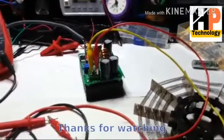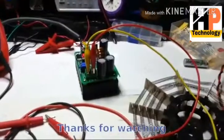Right, I need to have another little rethink about how I'm going to try and pull more power through that coil using this setup, because it can obviously do it, and the boost converter is alright at 12 volts. Maybe I should try the other power supply on this and see if the other power supply is giving out enough power. Yeah, that's going to be the next lot. I'm not going to do it tonight though, I don't think. I may do, but we'll see.